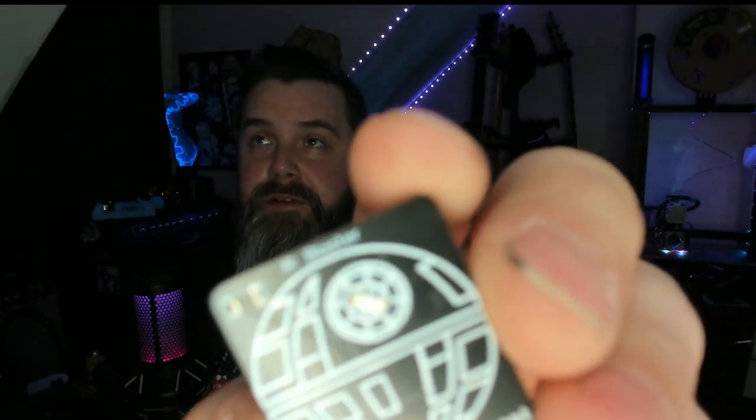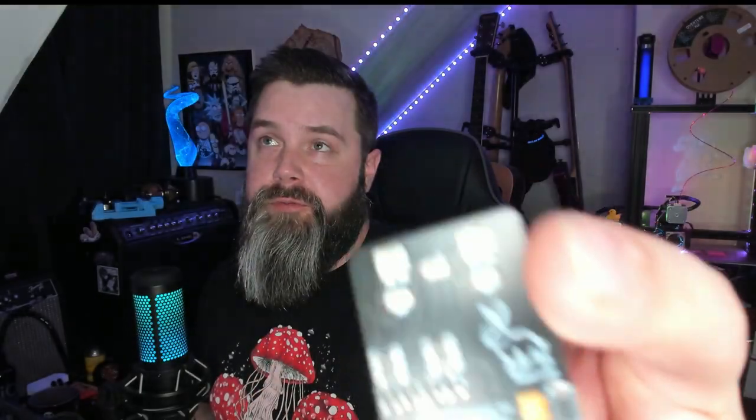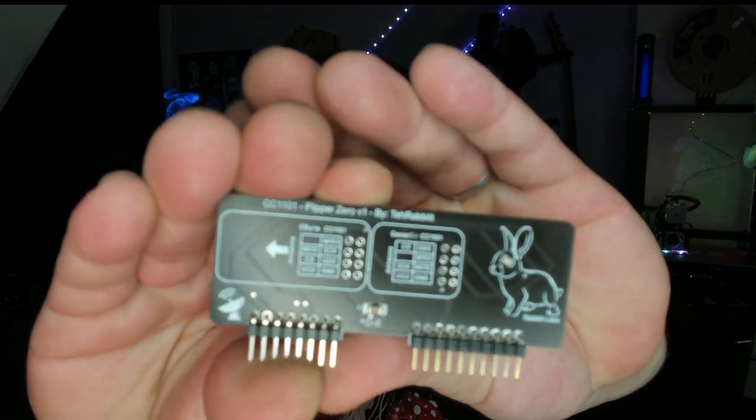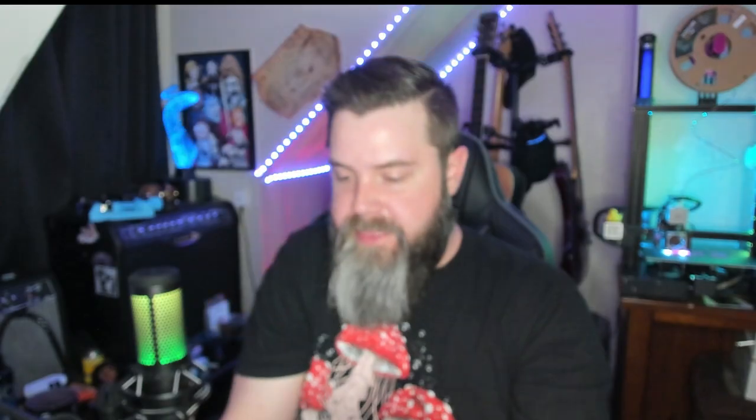The first thing they have is the IR blaster board. This thing's really neat — that's the front and there is the rear. I absolutely love the silk screening on these. They do a really, really nice job. And you can see all of the IR LEDs on the back. We've got the CC 1101 actual breakout board where you can solder your own card on there. And then we also have their version of the smaller CC 1101 stacked together. Keep in mind there are two versions — a right-handed version and a left-handed version. I have the left-handed version. They do sell the right-handed version, so know which one you have. They do have improper voltage protection, so if it's plugged in backwards, it shouldn't explode, which is always a good thing.